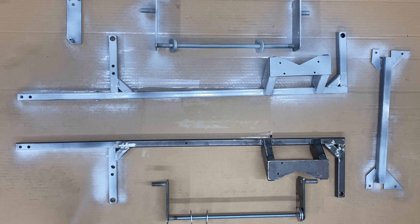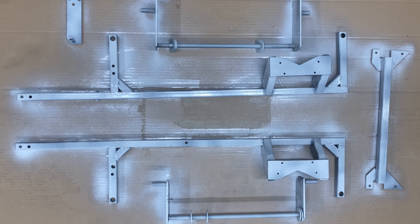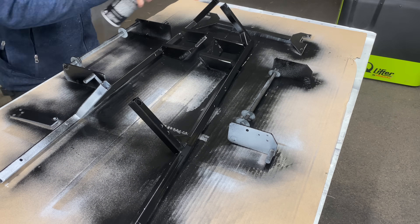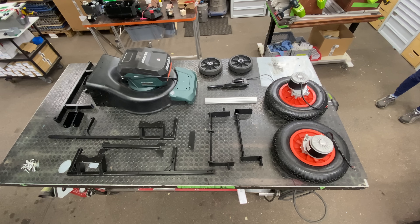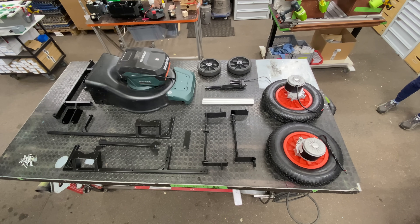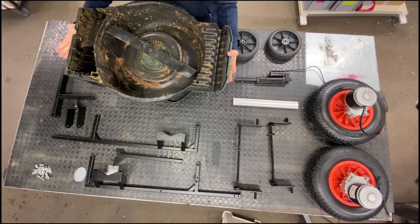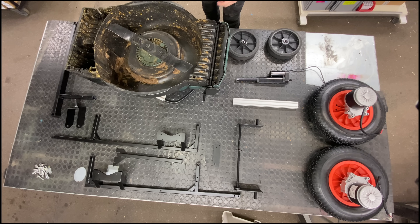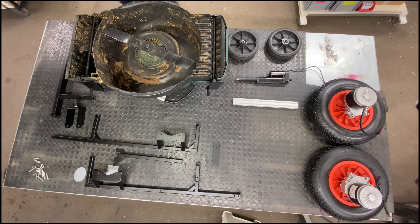Now it's time for painting. First I primed everything just roughly so the black paint has a good chance of sticking to the frame and will last a long time. I take health and safety very seriously — whenever I create fine particles like here I always wear a respirator, or preferably do it outside. You can see after some time how dirty your filters get and that stuff would have ended up in your lungs. So it's really important to protect your lungs long term — if you do stuff in the workshop you really should invest in a good respirator.